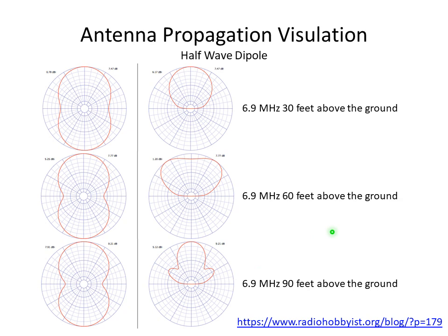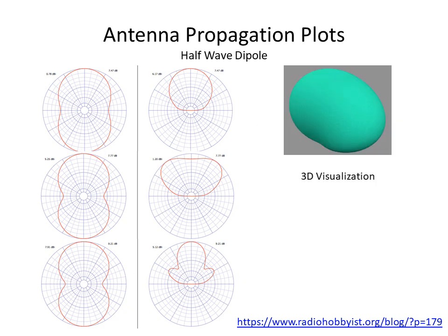The thing to realize here is that by adjusting the height above ground of a dipole, we can adjust this vertical propagation pattern. So that's just a tool we'll have in our toolbox. From a 3D visualization standpoint, it's important to recognize that what's actually propagating is a shape similar to a big symmetric blob radiating out from the antenna — it's just not single lines. These 3D visualizations for propagation plots really give you a better feel for the shape of the actual propagation pattern.